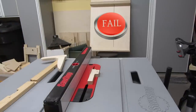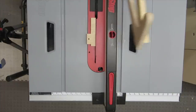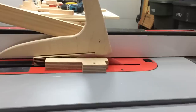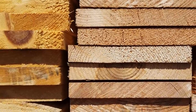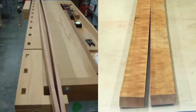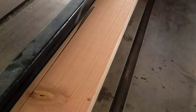Well that was pretty pathetic. Unfortunately, this ended up being the best I could do for this type of kickback. But you get the idea. You can see from this angle that as soon as the stock got away from the push stick, the friction between the blade and stock caused the stock to get kicked back. A misaligned fence isn't the only thing that can cause wood to get pinched. Natural wood, as opposed to manufactured wood like plywood or MDF, can contain enough internal stress that when you cut it, it warps. That can cause pinching between the fence and the blade, or it could cause the kerf to close around the blade, both of which could cause violent kickback.